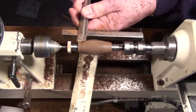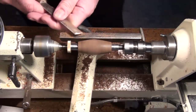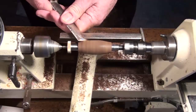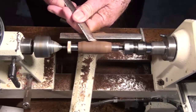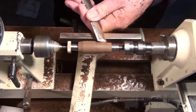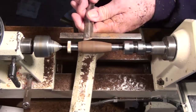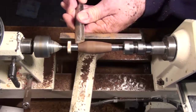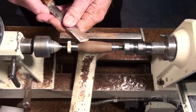This is a fairly sharp tool and we're going to approach this fairly slowly and I'm going to get a pen out of it — the first one I did not. This is the way that you do it after you've learned that you can mess them up if you don't watch what you're doing. We're just trying to bring it down a little at a time. I use the corners first — I always take off the corners first. My theory is that particularly on wood like this, it may chip out, but it will probably only chip out as deep as the cut is on the end of the blank. So if you give it some place to chip out to, it usually will not chip into the section you're actually trying to use for a pen — it will usually leave you enough wood to make a pen.